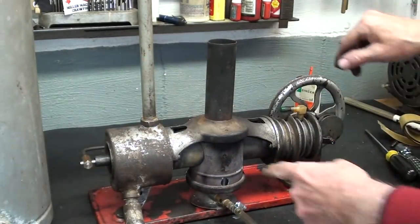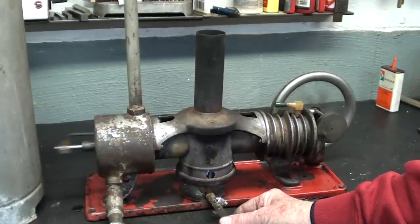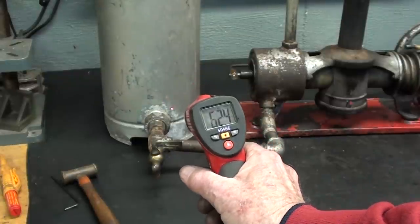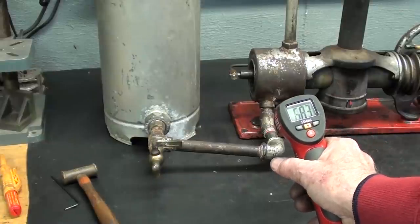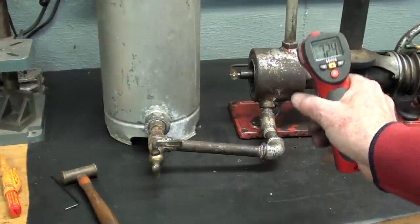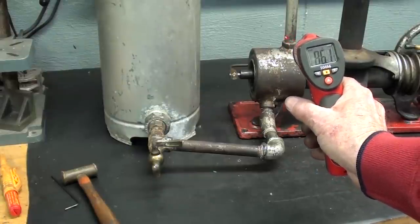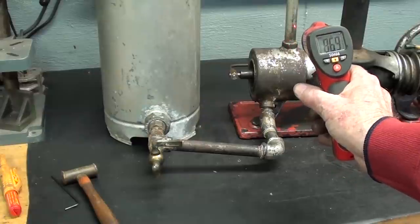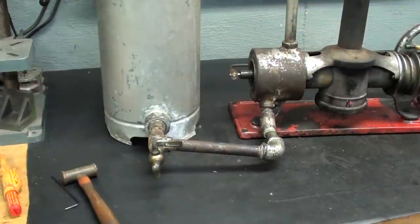The cooling system is full of water and the flame is on. Just as an illustration of how this thermosiphon cooling system works: the temperature right there on the tank is the same as the temperature here in my shop, which is about 62 degrees, and it's the same right there. But when we come up here to the outlet pipe, notice that we're at about 90 degrees — 88, something in there. So we've got cold and hot; the heat rises and the cold sinks. Just that simple.